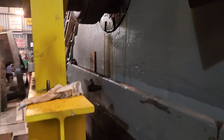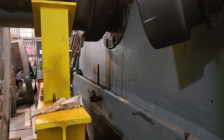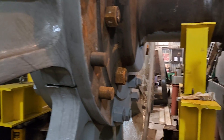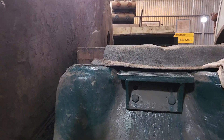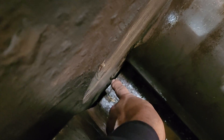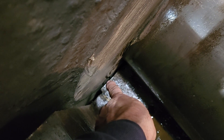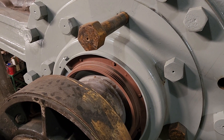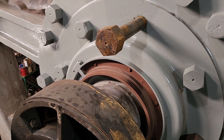While the crankshaft is up and the bearings are out, we'll go ahead and move the high-pressure bed plate and get it into alignment where it has to go. We also have to move the entire flywheel and crankshaft to the right about a quarter inch. You can see that little space right there — it's about a quarter to three-eighths of an inch wide — and that's too much. This whole thing is going to go that way just a little bit using heavy-duty machinery skates on the lifting rig.